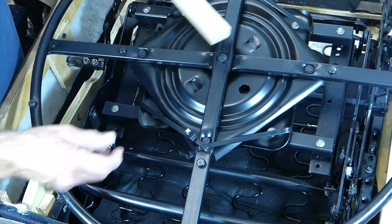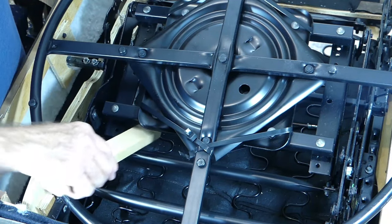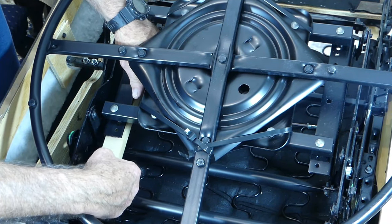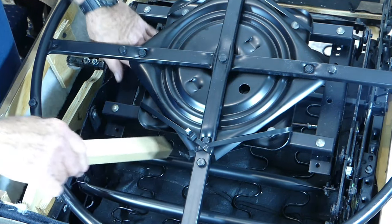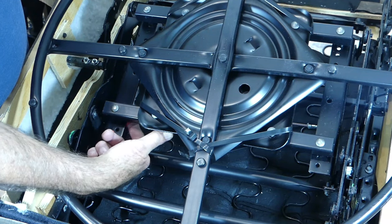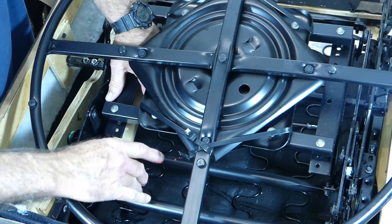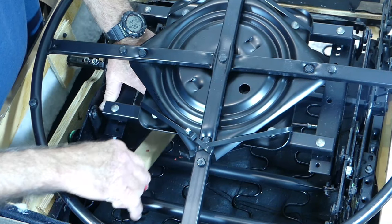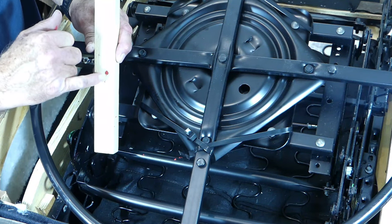I immediately have one problem — something you can't see in the video. See this bolt head? On the other side is a nut, and when I put the board in and butt it up against here, you can see the problem — look how this rocks against that bolt head. So we're going to need to drill a shallow hole for that bolt head to recess into first before we do anything else. I've put a little water-based paint on my fingers and I'm just going to coat the top of the bolt head with that, put the board back in, pull it against the brace and the L-bracket, and lift. And voila — that's where my bolt head is. So I need to drill a hole about halfway through, wider than the bolt head, and let it recess.